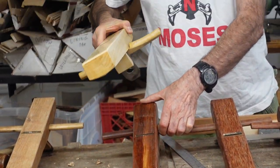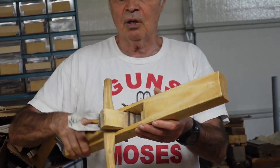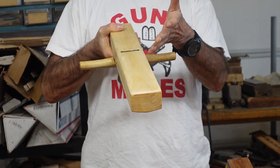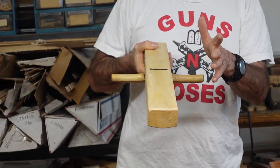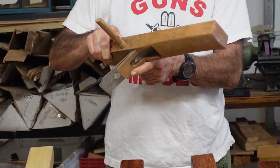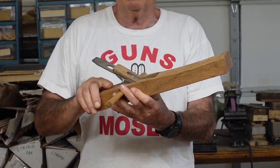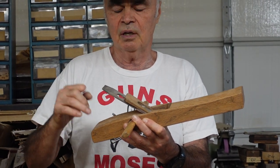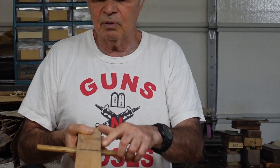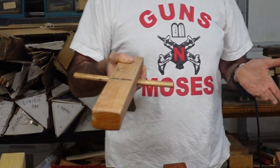This one I got from an eBay seller — I don't know what kind of wood it is, but it looks like some sort of yellow oriental hardwood. It's a longer jointer plane with a very wide mouth opening, so it's good for general jointing purposes, but not what I'd call a fine jointing plane. And last is a very inexpensive basic jack plane — I think I paid $12 for it. It's about 15 inches long and basically for cutting a lot of wood down to size very quickly, with a slightly bigger opening for rough work.